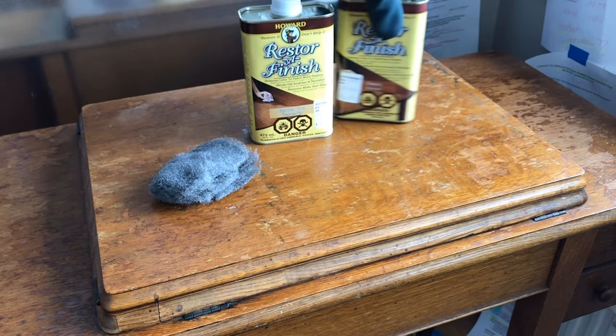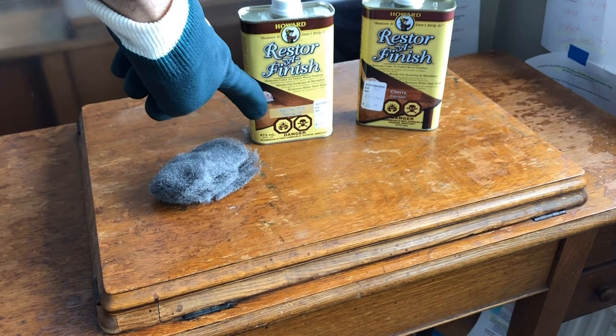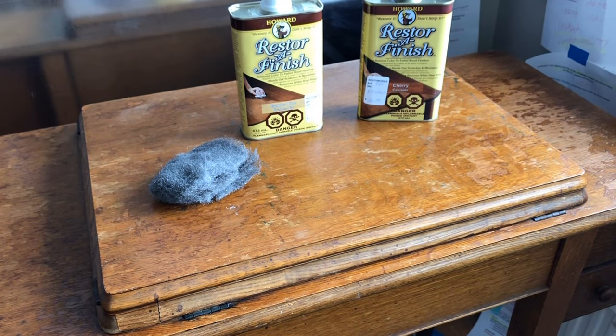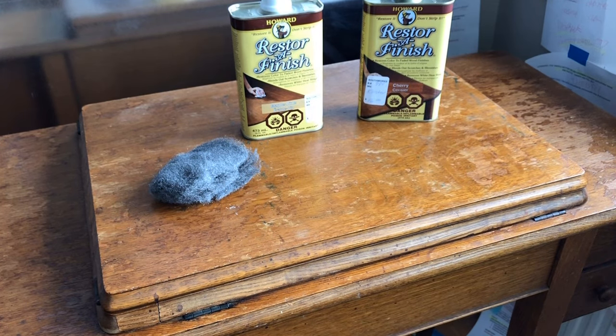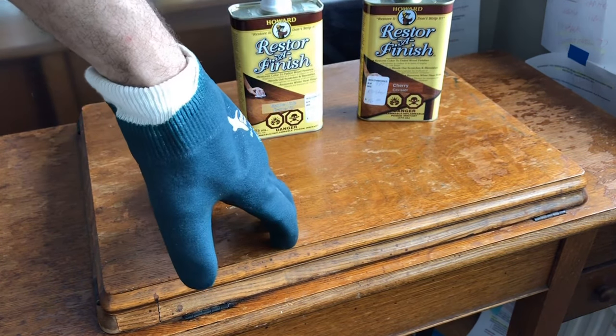The Restore Finish product comes in many colors — these are two of them. You've seen me using the walnut and the mahogany. They also have oak, light oak, dark oak, and so forth. Now the maple pine is a lighter color. The table itself I believe is actually made of oak, but that's irrelevant because with wood colors, these names like cherry and maple are only really useful as a reference for what the color is going to look like. It's not like paint obviously, so it has very little to do with whether the table itself is made of cherry or pine.